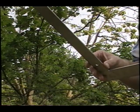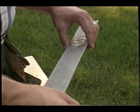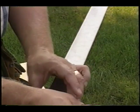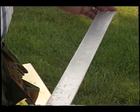What does it allow you to do? Lots of things. And most importantly, what I like about them — these are the things that allow you to cut roof rafters. Whether you're building a doghouse, a big house, a room addition, or a garage roof, this is the tool you need. A framing square is made up of two components: the tongue, which is the narrow part, usually about 16 inches long, and the body of the square, which is the wider part, usually 24 inches long.